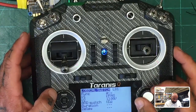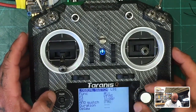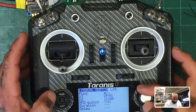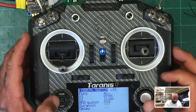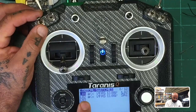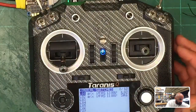And this will be a kind of quick cheating way to do this, but I want to say LO2 is not active, which would be the exclamation point. I think that'll work, right? LO2 is not active. There we go. So I think the way this is worded now, it says if LO2 is not active and we are below 13 volts, go ahead and play the battery. So it should do it right now, actually.